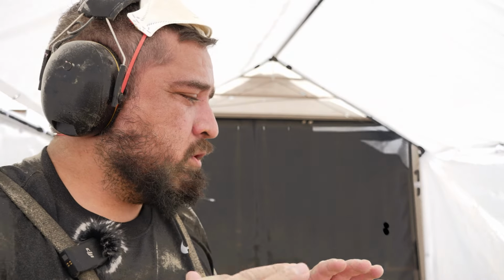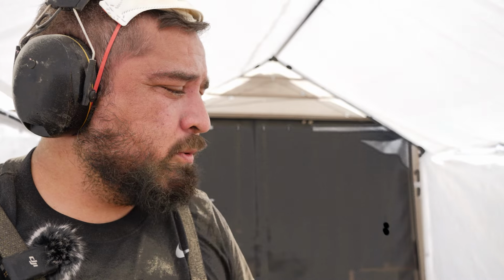So I'll show you right now. With the distance that I have in the plans for this, you'll have a little top that has a little extra, and that's meant to be sanded down, because if you put that bit too close together, that ripple will be pretty skinny and it just doesn't look right, because they'll overlap. So I make it where there's a little gap in between, and then you just go with a little sander to sand it roundish. I'll show you right now.